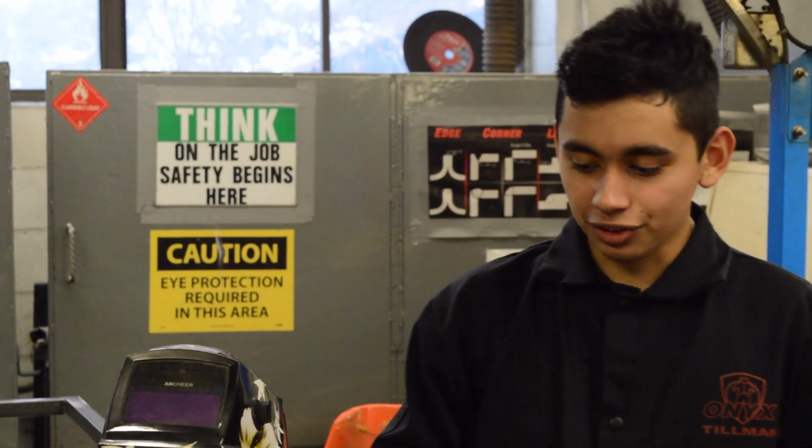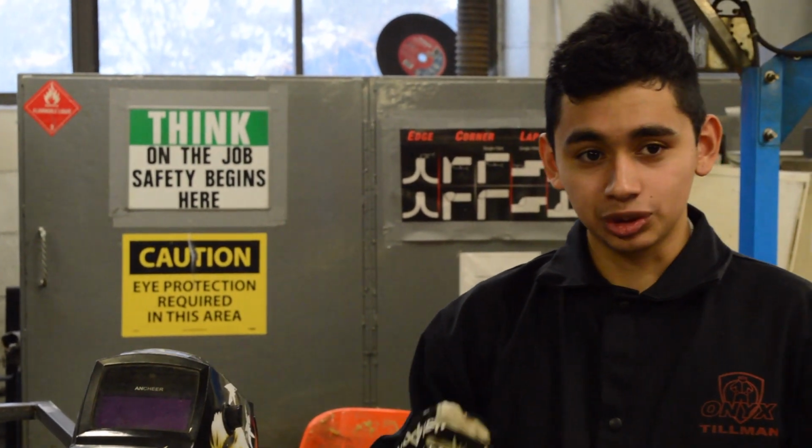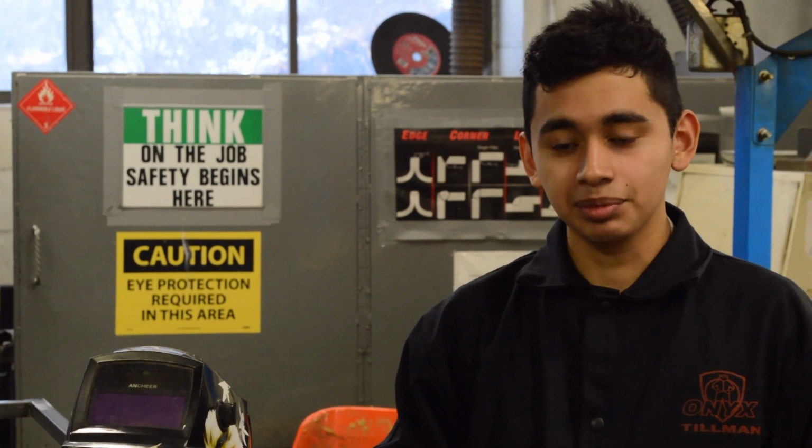Welcome to the molding shop. This is the brand new diesel car chassis. We switched from conduit to 1-inch square tube, 16 gauge, just because we need a wider wheelbase since we switched from prototype to urban concept.